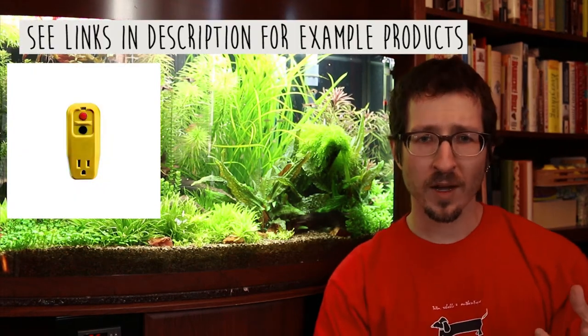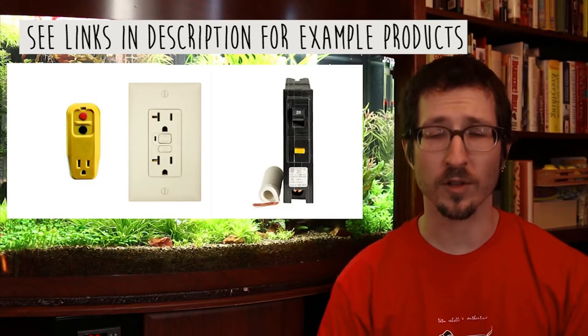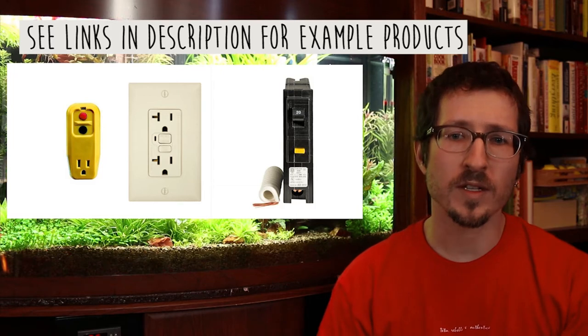So the next logical question is: where do I get one? There are various types of GFCIs out there. Some are portable, some are installed in the wall electrical box, and others can be installed directly at the circuit breaker — the main panel. Portable GFIs are self-contained units you just plug into a standard outlet, and then you plug your aquarium equipment right into that device. They have the advantage of not needing any electrical knowledge to install them, and if you move, you just unplug them and take them with you.